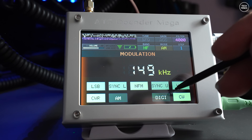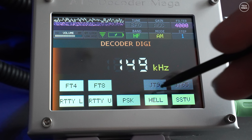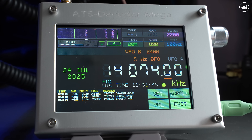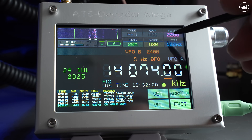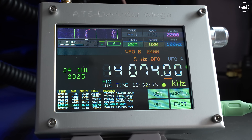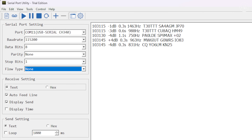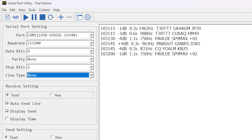As this is the Decoder model, it should support decoding certain digital modes such as FT4, FT8, RTTY, PSK, Hell, and SSTV. It does appear to decode FT8, but it did not decode all the signals it was receiving — it only decoded a couple of stations at a time and displayed them on screen. If enabled in the settings menu, the decoded data can also be sent to a virtual serial port when plugged into a computer, with the output in plain ASCII.